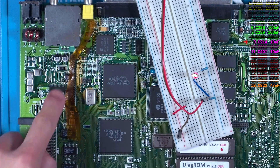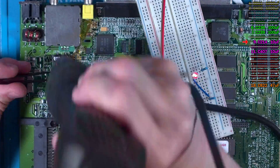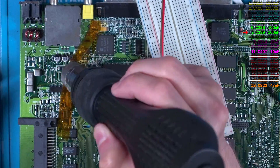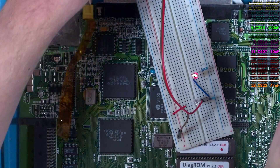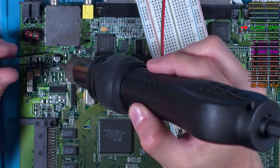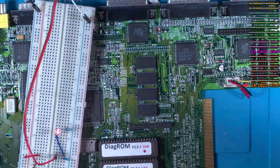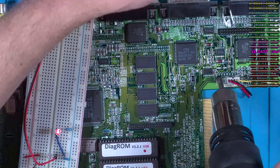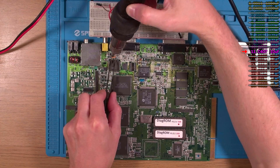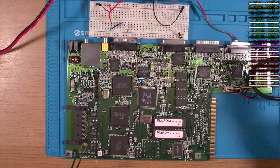Right next to the IDE connector is capacitor C214, sometimes labelled just capacitor 21 as the 4 is under the connector — but it's not that one either. Onto capacitor C239 — we can see it wasn't that one shorting out either. With just three capacitors left, we'll try capacitor C236 — no joy there. Down to just two, so let's have a look at capacitor C822 — still a short. And that just leaves our tantalum, C407. These troublesome capacitors can fail in very bad ways — so let's get it out. How annoying — it wasn't that one either.